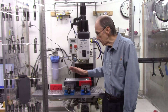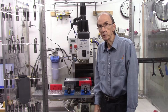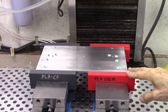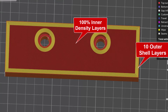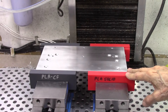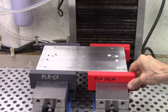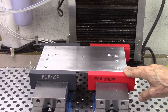To resolve the issue of the PLA jaws moving slightly as they were being clamped, I tried two additional versions of 3D printed jaws. This first set on the right was printed with the same PLA filament material, but the density was increased to 100%, providing a more solid PLA jaw with no filler gap holes in the center. This set is much denser and the deflection was much less, though I still observed a very slight amount of deflection. This set requires six and a half hours to print.